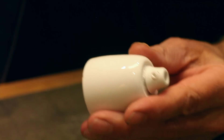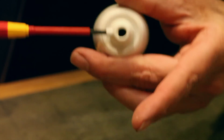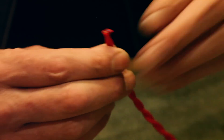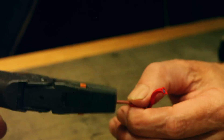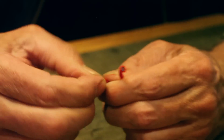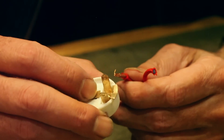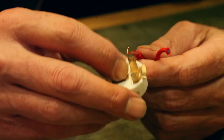I'm going to leave the cord grip in and just release its screw so we can open it right up to get the cable in. In this case we've got a pretty red cable. This two-core cable only needs two cores because we don't need an earth. We'll strip the cables — don't undo the braid too much, push back the cloth, strip the active, then twist and bend it. We're looking for the active terminal, which should be the center pin of the globe as a safety feature, so when you're unscrewing the globe you don't touch the thread which could be active.